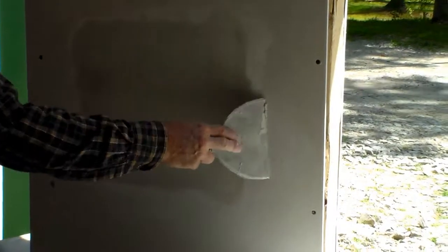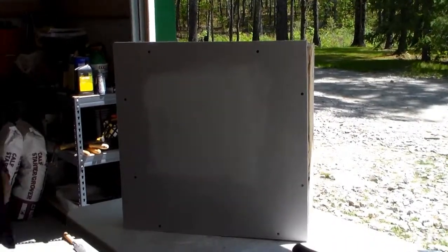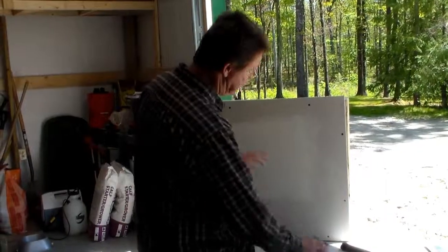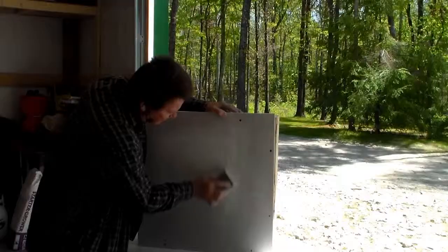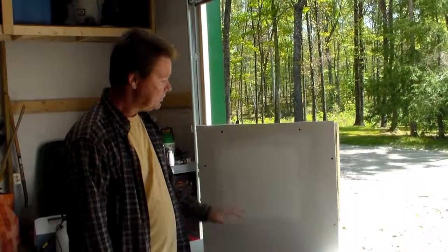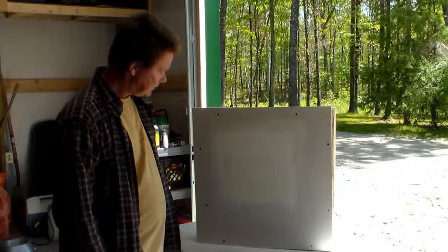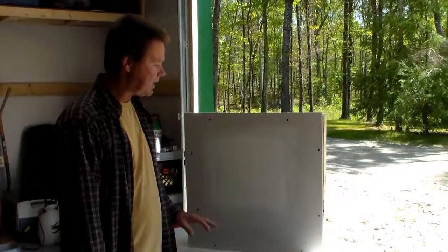We're looking pretty darn good right there. We're going to let it dry probably about 30 or 40 minutes. We're back — it's dried pretty well. Thanks for watching how to patch a large hole in drywall. What we're going to need to do is just light sand it and then it's going to be ready to be primed and painted. You can see it's pretty nice. At this point you would either texture it to match your walls, or if you don't have texture, you would prime it and then paint it to match your walls. And don't worry if it didn't quite cover — you can just go through step two again, skim coat it really lightly, let it dry, and then light sand it.